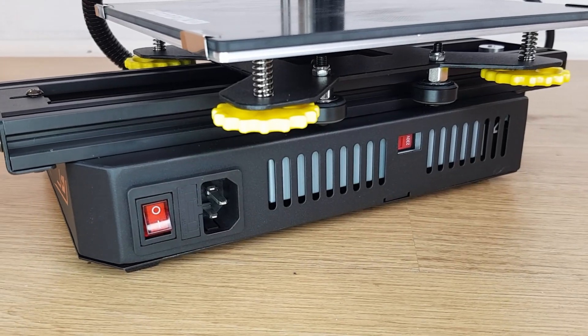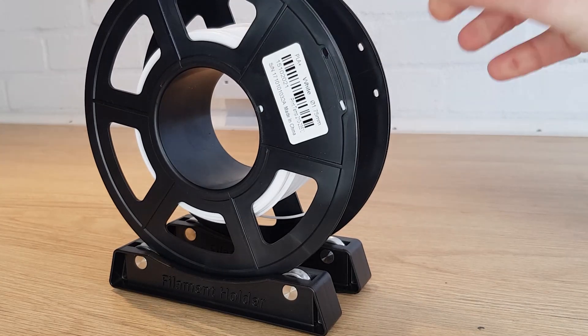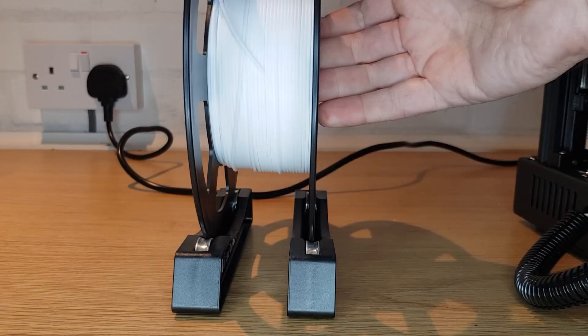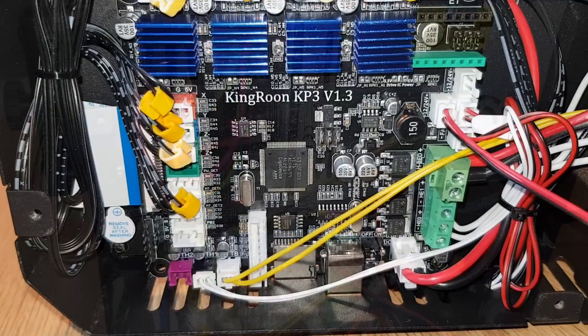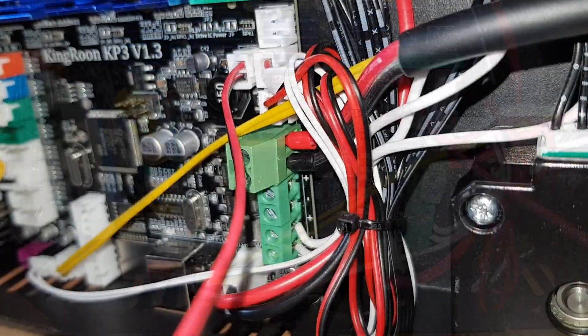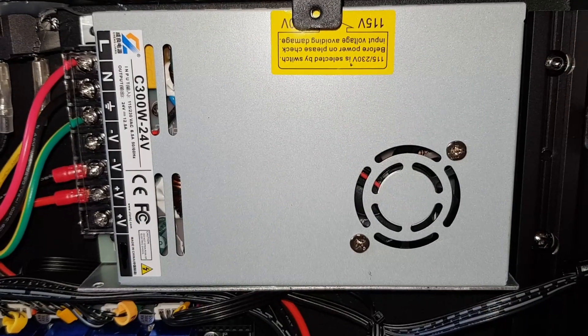The KP3S Pro comes with an integral power supply unlike previous versions, which keeps it nice and compact, but it doesn't really come with a spool holder as such — instead they provide a set of rollers for a filament reel to sit on next to the printer. These work well if you've got different widths of filament reels but they don't work very well with cardboard. When we look inside the base we find a 32-bit mainboard with ferrules on some but not all wiring connections. Those wires that don't have crimped ferrules at least don't have soldered ends, which can be a real safety concern in some 3D printers.